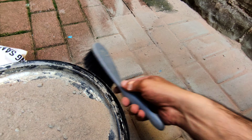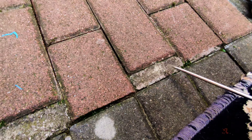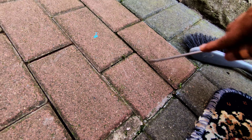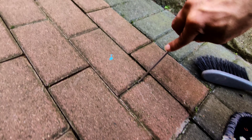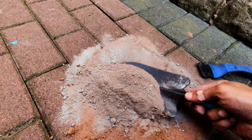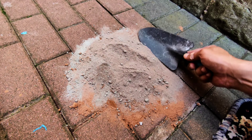The mix is a good mix — just to recap, it's two sand to one cement. I realized I made quite a lot for the area because the slab gaps were deeper, but these brick gaps are not as big, so any excess mix can be saved for bigger gaps. I might also try a cement-only section without sand, since cement is finer and might get further into the gap, though sand and cement mixed together is stronger. The mix color is also closer to the reddish-pink tone of the paving blocks themselves.